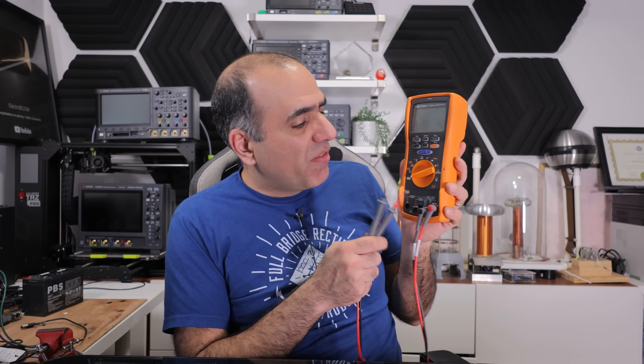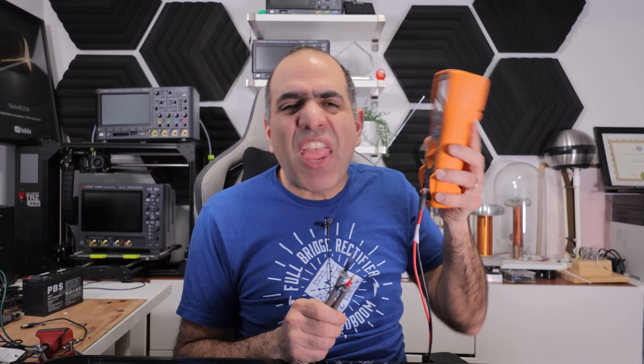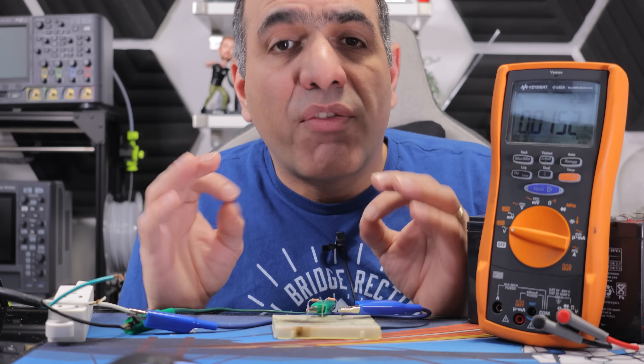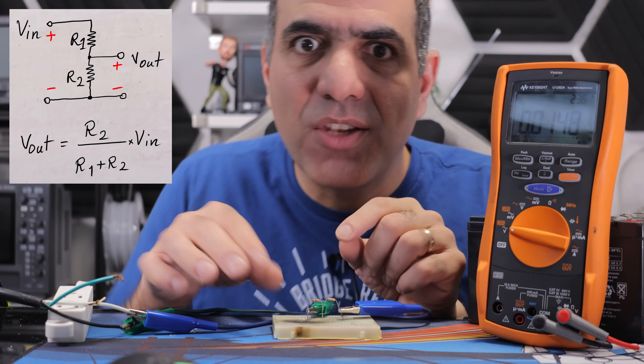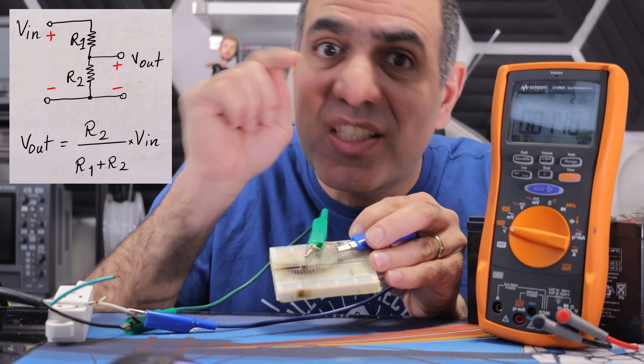Anyway, these devices are designed to handle 600 volts or a thousand volts, which is pretty good, but I'm talking about tens of thousands of volts, not just a puny thousand volts. Of course, the simplest way is to divide the voltage down below what your measurement device can handle. A resistor divider is the way to go, where the input voltage can divide between two resistors.